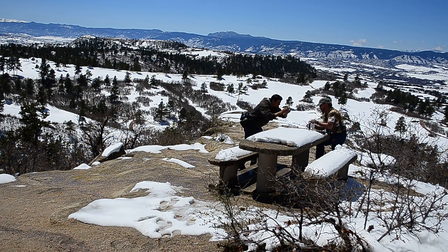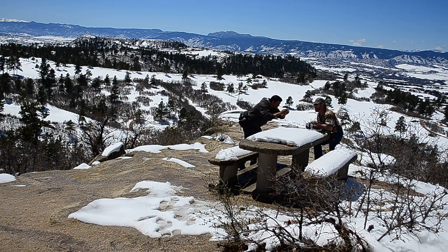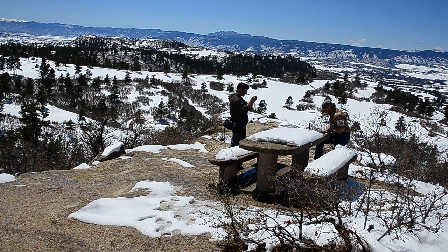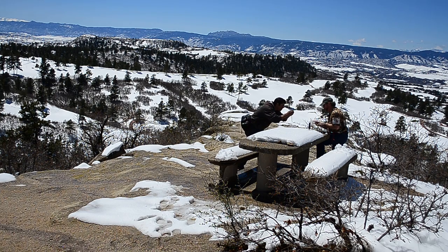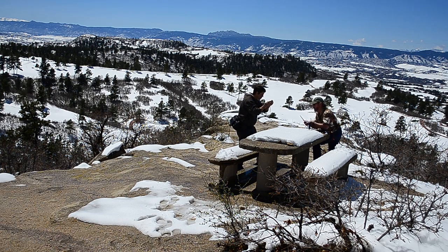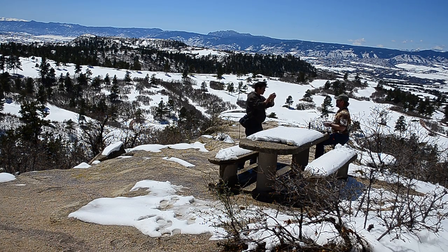As thick as the butter knife is, the V is going to put it somewhere in the neighborhood of a 22 degree angle — that's almost too thick to really slice paper. But you can see that it's actually cutting paper pretty good. Right now I'm at 3 minutes and 24 seconds — it's well under the 4 minutes. So let's hurry just a little, and I'm going to bear down on the sharpener just a little. It's really hard to get the serrated edge off that blade because the V notch is going to kind of follow it. That's sharp enough. This is Brad, sharpensbest.com. Watch the video, take care, have a good day.